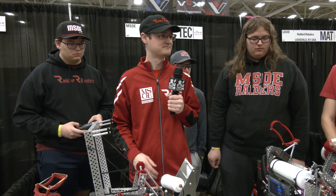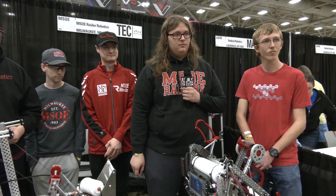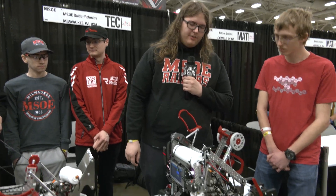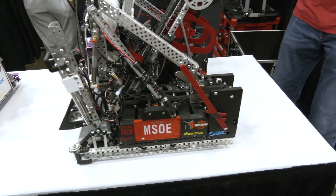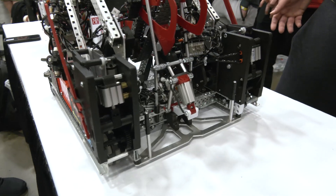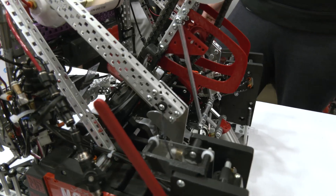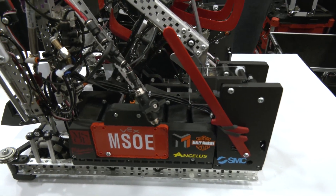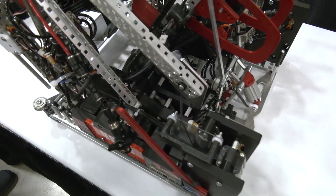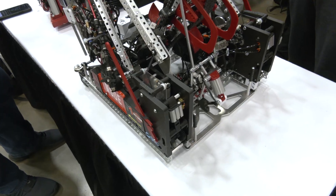Let's talk about the transmission and pass over to Landon. You're doing a 5-to-1 transmission — can you talk more about the composition of it and what it's actually being used for? Our transmission is a 5-to-1 shifting from 600 RPM to 120 RPM, where the default gear is 36-to-36 and the low gear is 12-to-60. We found that this pushes quite a bit of power and we can almost push two robots with it. Our strategy required this because we expect defense when going for tier three, so we wanted enough power to get from the positive corner to our hang bar while still having enough time to climb.